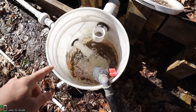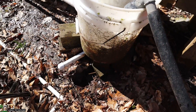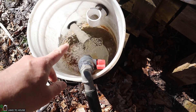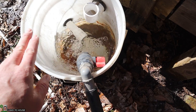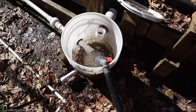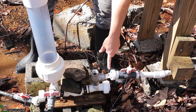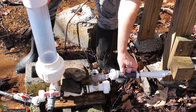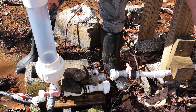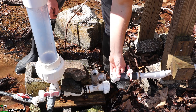Inside the bucket, the drive pipe sits midway up, which gives approximately six inches of silt catchment at the bottom. Right now the drive pipe is open, so all the water is going down that pipe. Whenever the bucket is full, the overflow goes into the overflow pipe. I close off the drive pipe to allow the air bubbles to leave back up at the bucket and give me a chance to get everything connected.